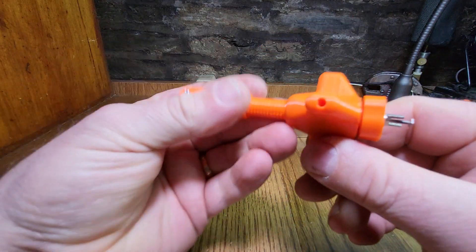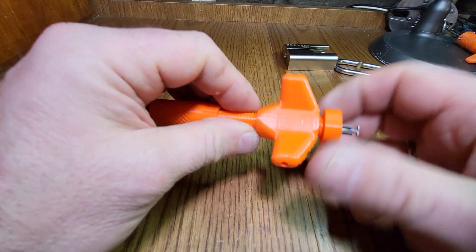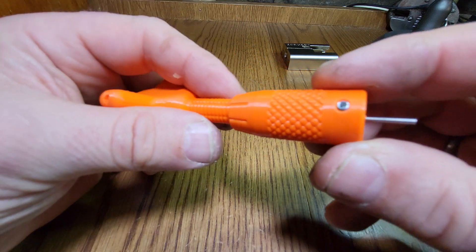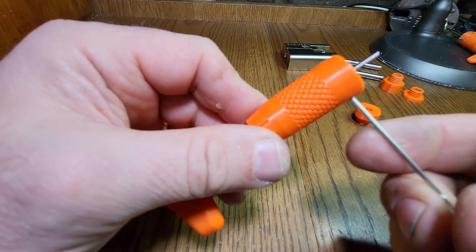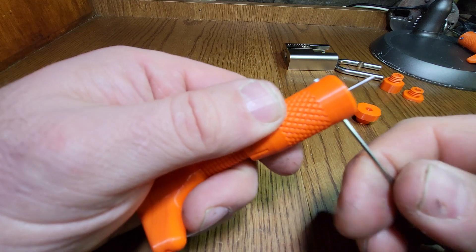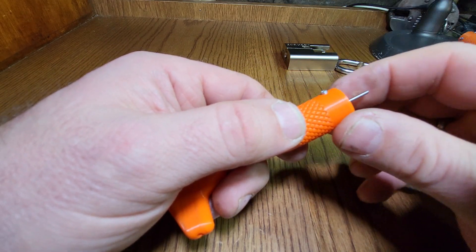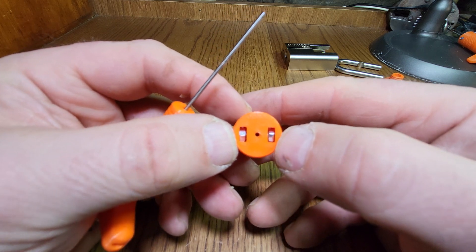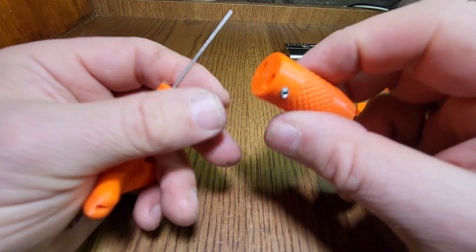Let's take this apart and have a look at what goes into putting it together. First things first - all of the screws, grub screws and nuts are M3. The grub screws are 8 millimeters long with a 3 millimeter thread, and the 3 millimeter nuts are just standard size. The nuts slot through the top of those slots and the screws through the side - it's a really fantastic design in terms of robustness. I love the thinking that went into this.